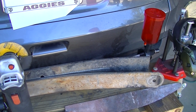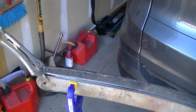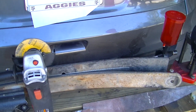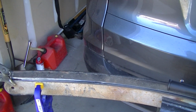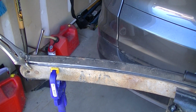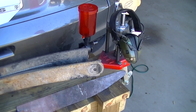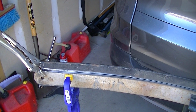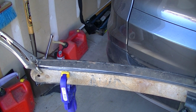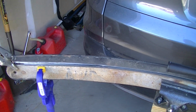So I've decided it's better to cut and shape my sword out of a piece of steel, then heat it up and straighten it out, and then go to the trouble of quenching it and doing all that. We'll get to that later. But again, with this steel, it's a lot easier to cut it into the shape you want than to try to blacksmith it into the shape you want, unless you have high-end furnace capabilities, which I do not. I don't have access to a forge hot enough to shape the steel properly.